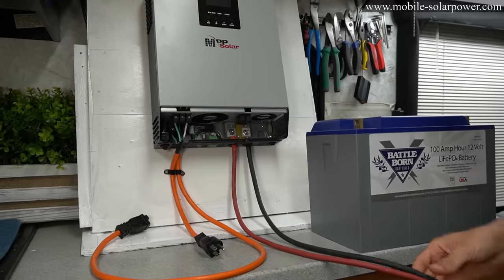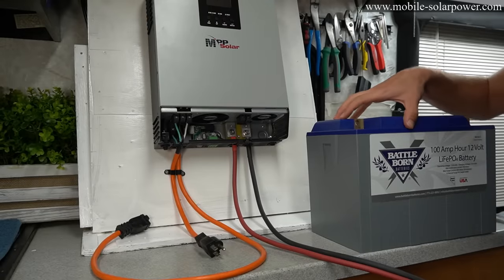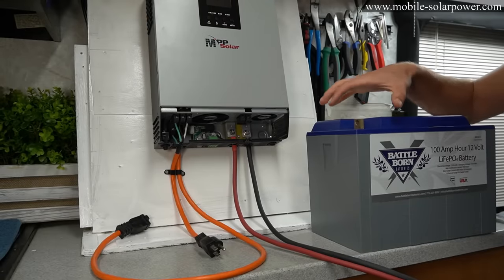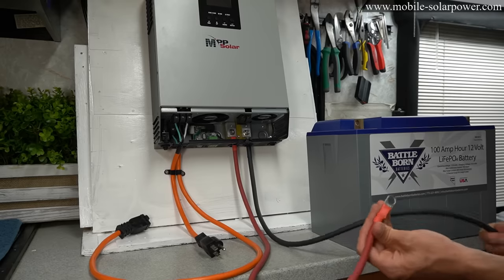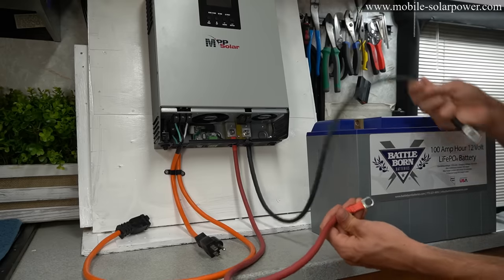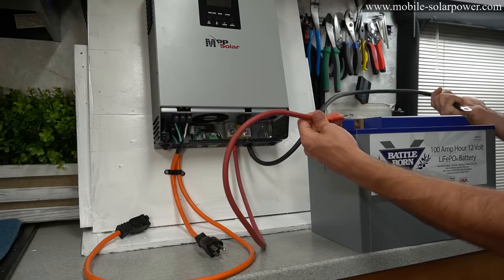Now that we have the AC power cables and the battery cables, we're going to attach the battery first. And because this is a Battle Born, it has its own overcurrent protection. If this was a lead acid, you would have to add a fuse to the positive. But we don't have to, so we're going to attach these bare wires directly to the positive and the negative